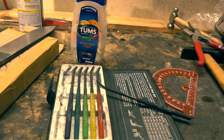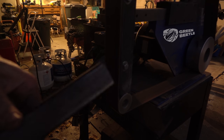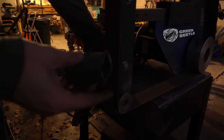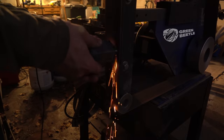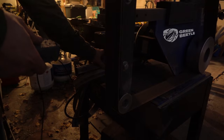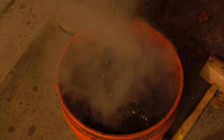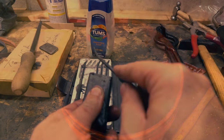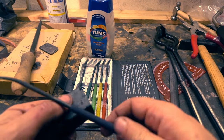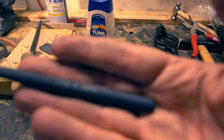So we didn't make blister steel — but wait, are those early blisters on the container? Or is that spatter from the weld? Here's our container material at baseline: mild steel. Here's the container we used for carburization — it's sparking like medium carbon steel. When we quench it in water it gets to the high 50s HRC with the hardness files, so it's definitely probably a medium-ish carbon steel, maybe on the low side — 1045 or something.